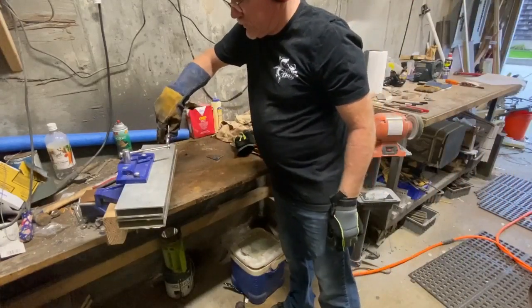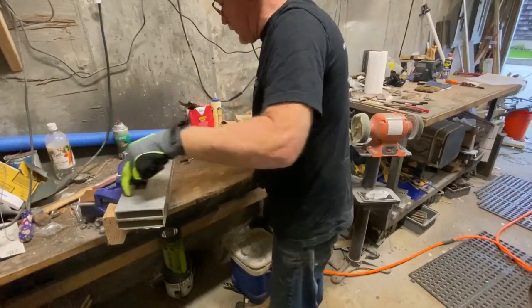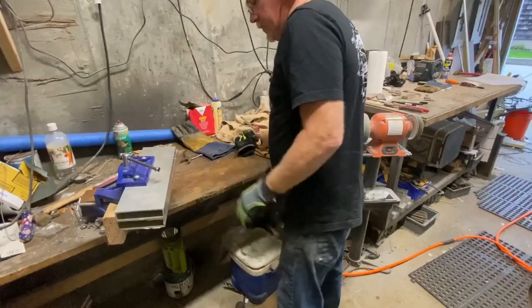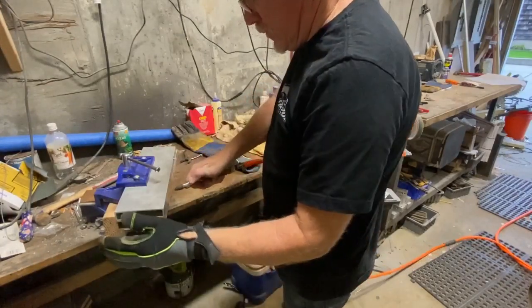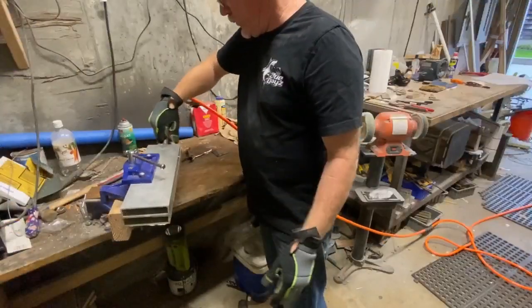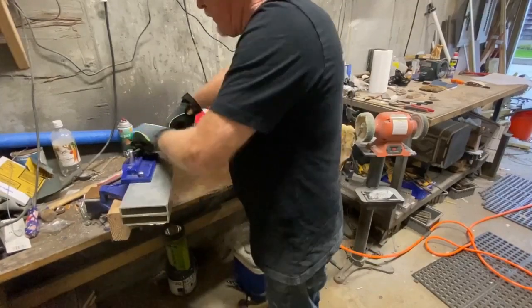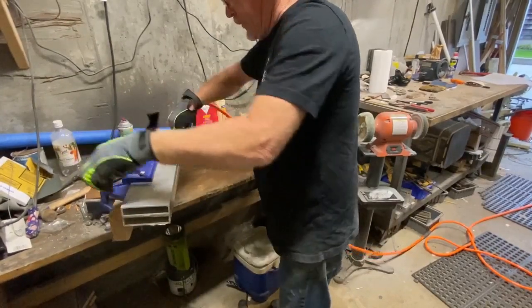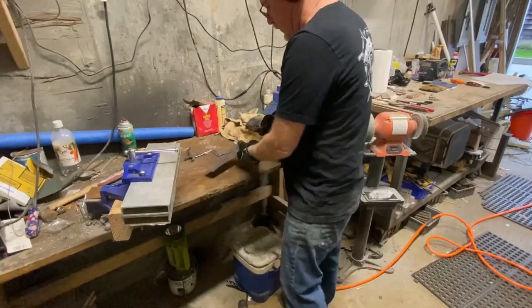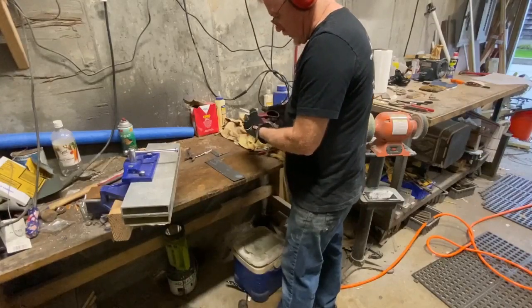So what I do is I clamp it in between two pieces of aluminum tubing. That keeps that blade nice and straight, nice and flat. And then I use compressed air and I blow it in between each one of the tubes and also through each tube. And you really want to cool it as quickly as possible. Once it's cool enough, it only takes a few minutes to cool down, I can take it out and cut it out of that tool wrap.